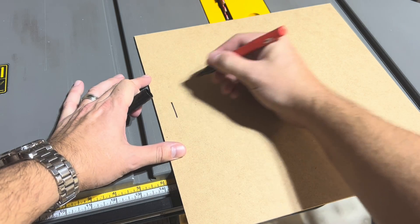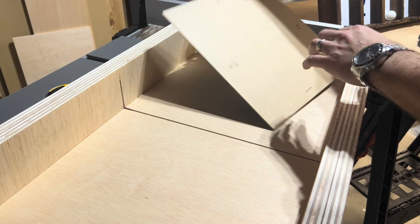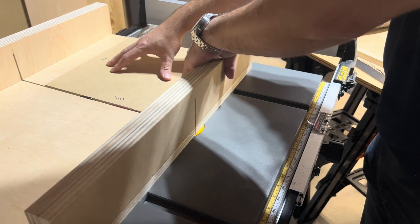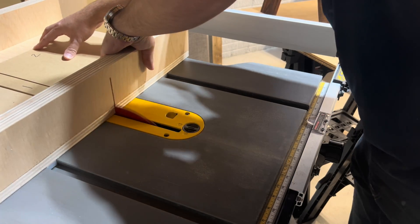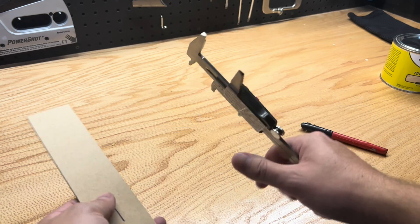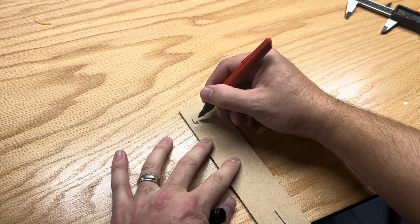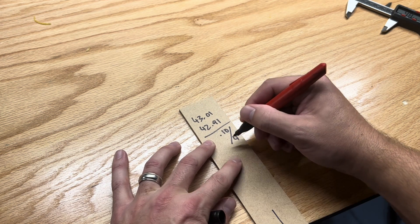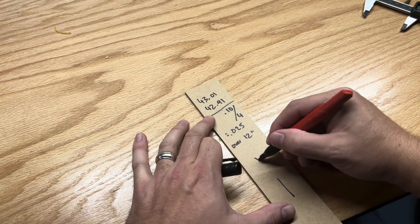Use the 5-cut method to dial in the front fence to the base. To make it simple: take material off five sides and the last cut of material removed should be parallel. I removed about an eighth inch of stock from the first four sides and made my fifth pass at about an inch and a half. The exact amount doesn't matter as long as you have enough material to measure the front and back — a digital caliper makes it super easy. The front end measured 42.91 millimeters and the back end was 43.01 millimeters. To adjust: if the back end is wider than the front end, move the left side of the fence forward one quarter of the difference. With the margin of error from front to back being less than three thousandths, this is about as perfect as it gets.